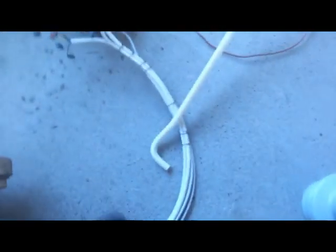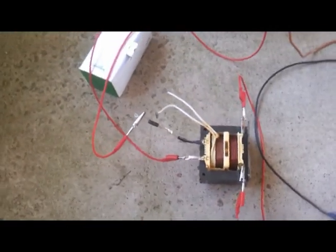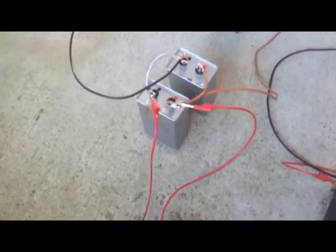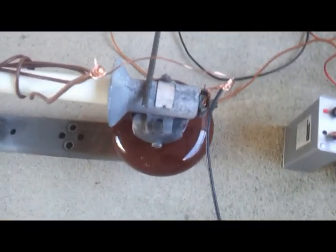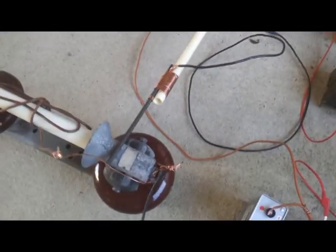I got the wire and a control switch. Here we got the main part: there's a wire from the 24-pin connector and it goes to an isolation transformer, MOT, diodes, rectifier. It goes to two defibrillator capacitors rated 5KV, 40 microfarad. And here we got the fuse holder and that isolator — that's what she can short it out with.